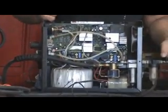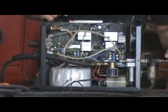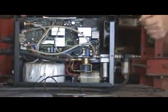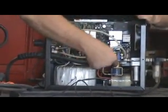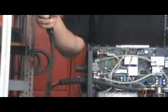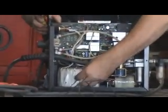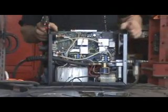You can see where the air comes in for the torch. It comes in here on this end. We've got a little filter right here to keep the water out. There's another little filter inside here, a little dryer. Comes up through the pressure regulator over here, and then back down to the torch. Comes out this cable, winds up out on the end. So when you pull the trigger, the air comes on, and it may let you make your cut. Circuit board with all the electronics. Here's the other side of that big transformer. A little cooling fan to keep things cool inside.